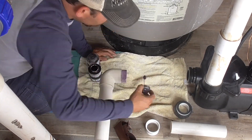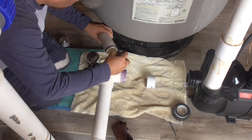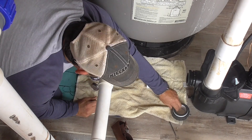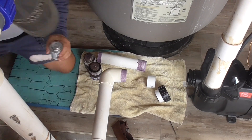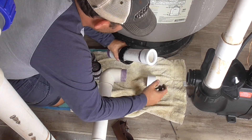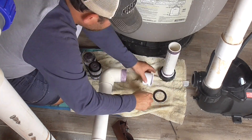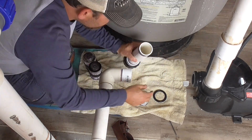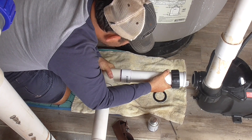Now I'm setting up for the new pump. I'm priming the pipes — the purple stuff is primer that cleans the PVC — making sure I have a good coating before opening the glue. I'm getting the first pipe all put together. They give you some nice fittings to join the pump to the PVC, and you don't need any Teflon tape. There's a pretty good-sized gasket, so it is removable without much work.